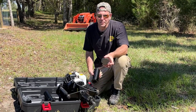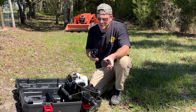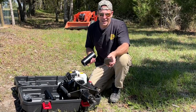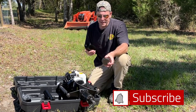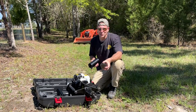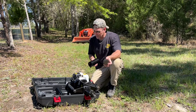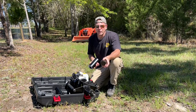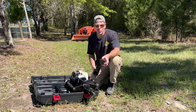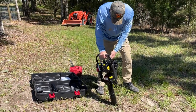There are pneumatic ones that need an air compressor, running $500 to $1,000. This particular one was at Home Depot and the day I checked it was $200 off — I think it was a $500 machine — so I jumped on it. We have a lot of fencing to do here at Piney Grove and most of the cross fencing will be t-posts. I think I'm actually going to enjoy putting in t-posts with this. We haven't started it yet, so I'll put it together and crank it up. For the first six hours you can only run it at 60% throttle, but I'm sure it'll do a good job in this soil.